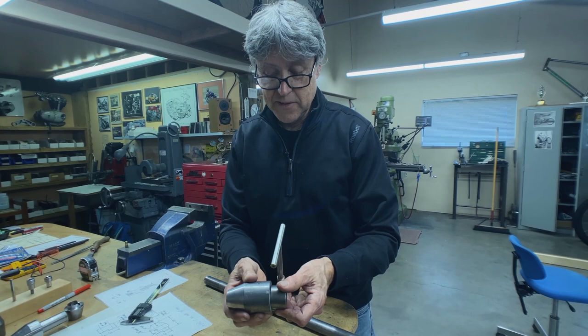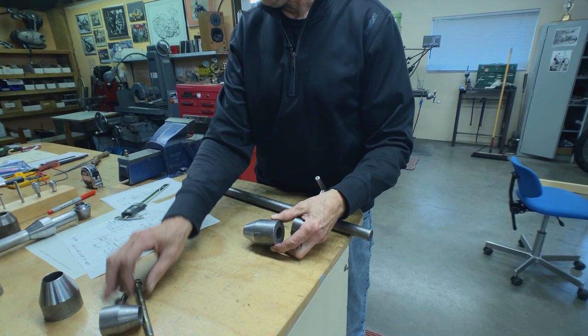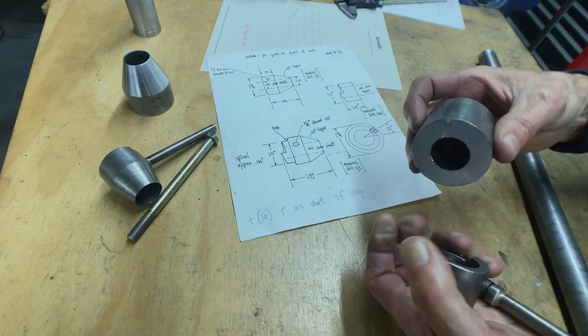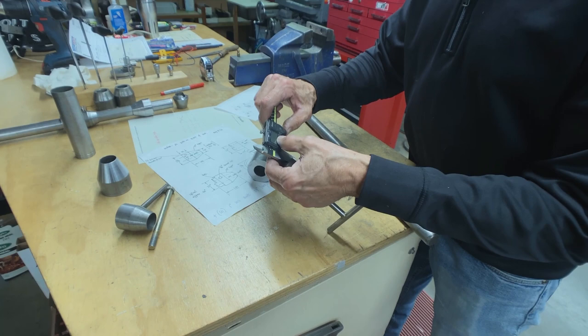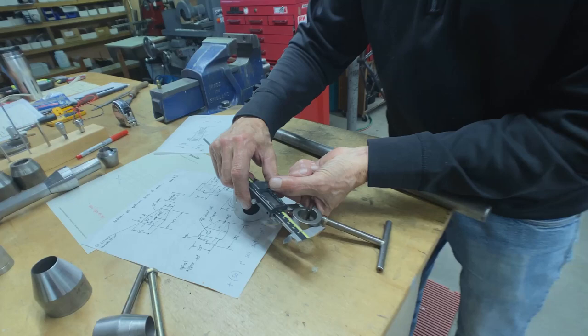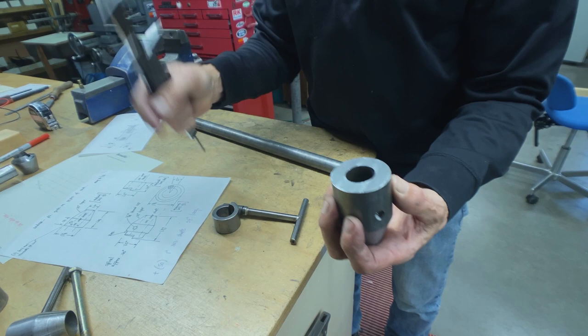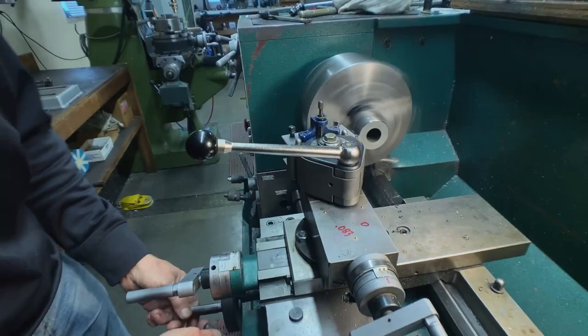This is going to go up against this, and you can see how this is obviously larger. I do have a drawing here that I made a bunch of years ago — you can see how it necks down and it's got a nice radius in here. So I have to match this size to this. I'll switch on my vernier, put that like that — it's just under an inch and a half, and I'll zero it. So when I put this in the lathe in the three-jaw chuck and this comes down to zero, I've got the same size as this. Then we can work on the ramp.